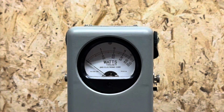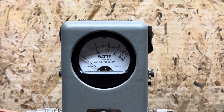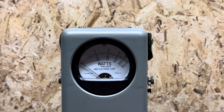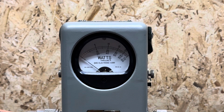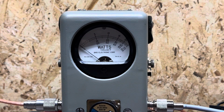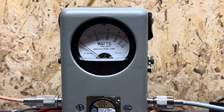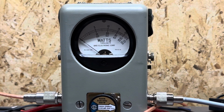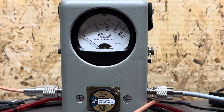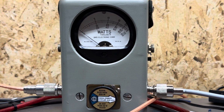And that's honestly where I would recommend running it, because lots of people try to crank as much power out of these as you can, and that's kind of where they detonate, in my opinion. It was doing a little bit more, but I cranked it down a little bit because I'm not trying to squeeze every watt that I can out of this radio, just because I know how these radios operate. I've killed a few myself. So we keep it around the 115, 120 watt mark.